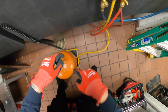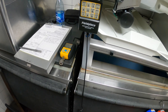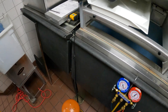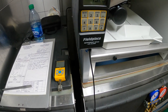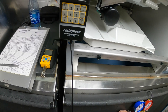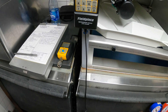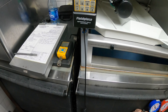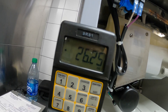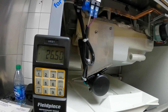I already purged. Tank is open, let's charge it up. It's slowly climbing up. 16 plus 10.5 is 26.5 ounces — excuse that. I'm going to get close over there. Also, when we take off the gauges, we lose a little bit of gas, so I might add just a little bit more — just a quick shot. Anyways let's get that in there. 26.25 — I just saw 26.5. Let's give it a quick shot. 26.5 ounces, refrigerant 404A.